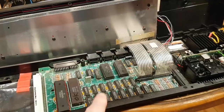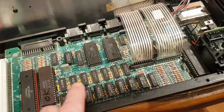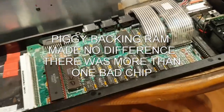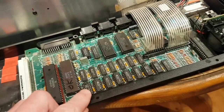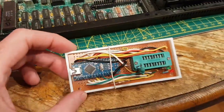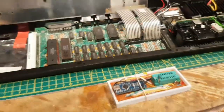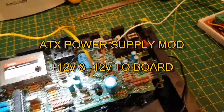This one had been sitting in a cupboard for ages with a white screen. These chips down here are the upper RAM and the chips along the top are the lower RAM. If you get a garbled screen like a tartan image and then it goes white, that means the upper RAM is at fault. Using a logic probe I found the CAS line was stuck on the upper RAM chips. I unsoldered all of them, tested them one by one in the RAM tester, and found three were dead. I changed them and the system booted.